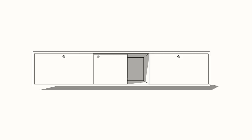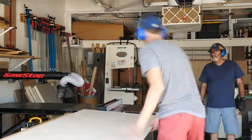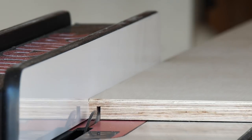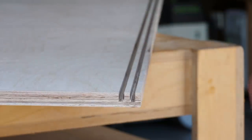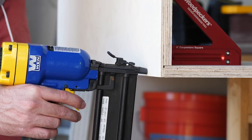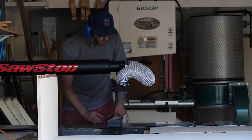The next thing I needed to do was cut a pair of grooves along the insides of the front of the top and bottom panels. These are eventually going to hold three sliding doors. You could use a router again with a smaller bit, but luckily my parents had stopped by so I enlisted my dad to help me support the workpiece while I pushed it through. The trick is that you want to use two different blade height settings — the top should be deeper than the bottom so it allows enough clearance that you can take the doors in and out easily. I'll put up a drawing that shows it to make it more clear. So with the four exterior pieces finished, I could start assembling things. After I had the bottom and two side pieces attached, I used one of the sides as a reference to determine how wide I should cut my vertical partition pieces.